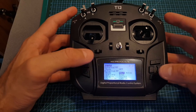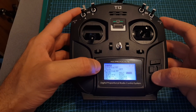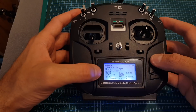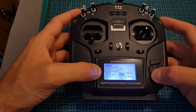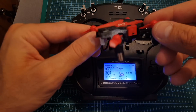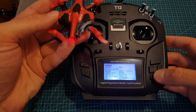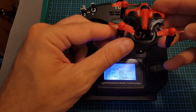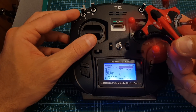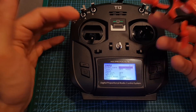Under the external RF we can configure the multi-protocol transmitter. We have a sub-menu where we can move between different types — for example now MJXQ is chosen and under the subtype I can set it to Eachine E010. After plugging it in I can go down and press bind, and now you can see the receiver is bound. After pushing the throttle you can see that it's working, however you will need to modify the order of the channels in order to make it work correctly.